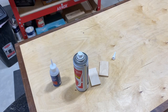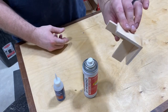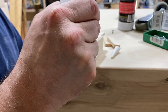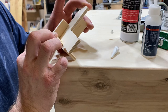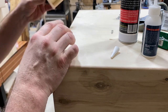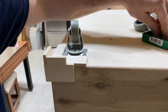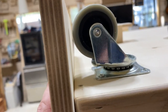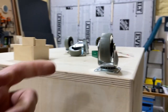Now we're going to flip that piece upside down. Before I install these casters, I'm going to make myself a little 90-degree jig using some Starbond and some activator — I use it more like a tool than a glue. This is going to give me the gap I need exactly to have these casters put in place at the corners for repeatable results. I needed to tack in two more pieces to do it on the other side. You put it there on a 90 degree, rest your caster up against it, and install it. These casters are in this place for a reason — I don't want these wheels to ever come outside the piece, so no matter where you roll this up against a wall, the wheels will never hit a baseboard.